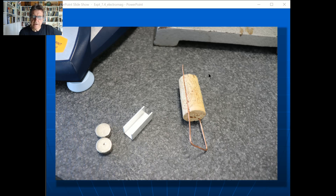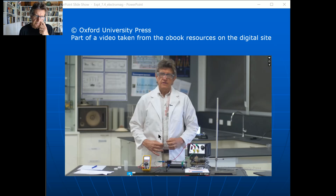Here are the bits and pieces I used. That's just a cork out of a wine bottle with a piece of copper wire through it. I've made the copper wire length match the diameter of the magnets so that all of the wire is in the direct magnetic field. There's a little piece of aluminium channel from Bunnings — one centimeter by one centimeter — and these little button magnets from Aussie Magnets: 1.5 cm diameter and 5 mm deep. They're quite strong, good little magnets.